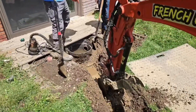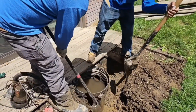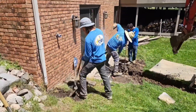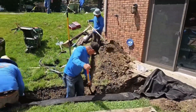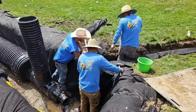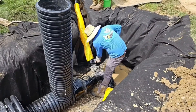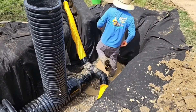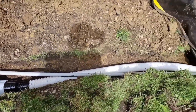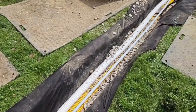Right here is an indoor sump pump pit installed outdoors. Never do this — this is something only hacks do. Do not use a small indoor sump pit outdoors like this; it's such a liability. Easter egg: do not take your foundation drain all the way to the bottom of your detention tank. Keep it as high as you possibly can. You need a little bit of slope, but do not go too deep — if the tank fills up, you don't want it to back-feed into your foundation drain. We have a leaf filter to catch leaves, a catch basin to catch sediment. We don't want to fill the detention tank with roof debris. We took every precautionary measure we possibly could.